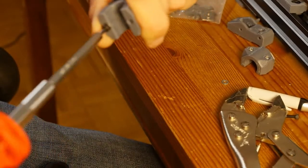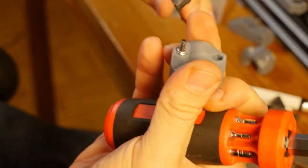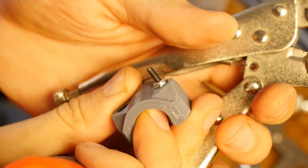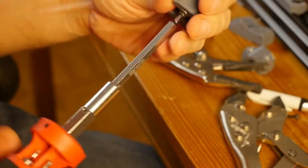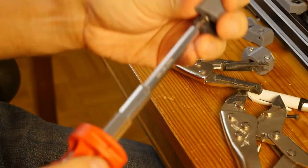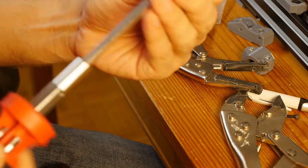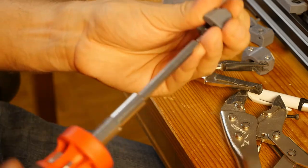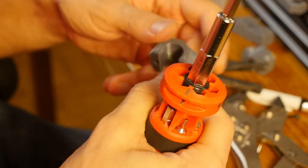Probably it might stick long enough. Okay, let's check how the nut is going. Yeah, it's going fine. It's kind of halfway in. It's going all the way in. Yeah, and I hear the crackling, which means stop doing what you're doing immediately. You know, there are wrenches with a torque setting, and they start to make sounds when you exceed that torque. So this is a much simpler system. The printed piece starts to make that sound.